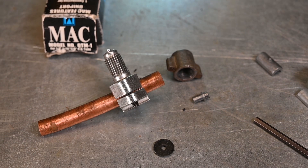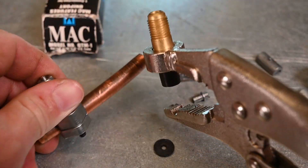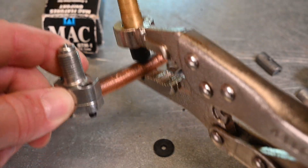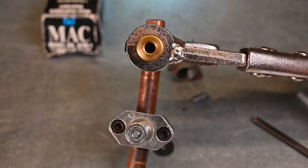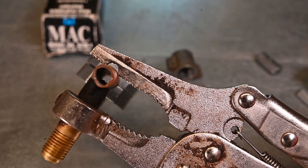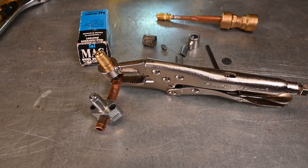Now let's compare all that process to our tool. We have the groove, the bottom piece of the groove of the tool, we put it right there, and then simply clamp down. Boom! Now we've punctured it and we're ready to recover refrigerant all in one fell swoop. So there you have it - three different ways of recovering equipment from a pump down, and two different ways of recovering equipment from a Type 1 appliance with no service ports.